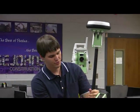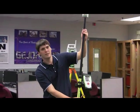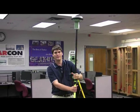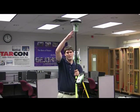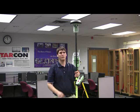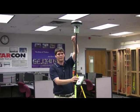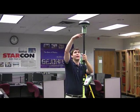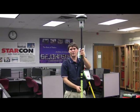Another thing you should always remember is to loosen the collar and bring the antenna all the way to the top. There's a little push pin here and you lock it down. The reason is that GPS does not measure to the point at the bottom — just like a prism it measures to right here, so if you're at an angle you're now off. It's very important to keep it plumb and locked in, because the instrument is set to a two-meter pole.